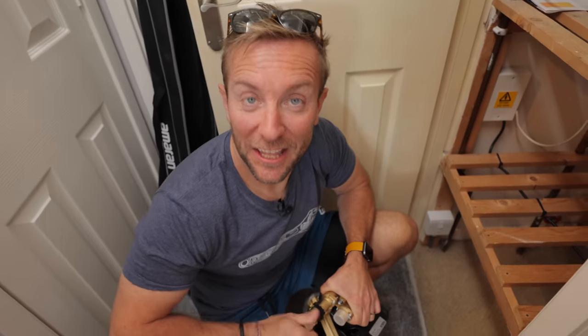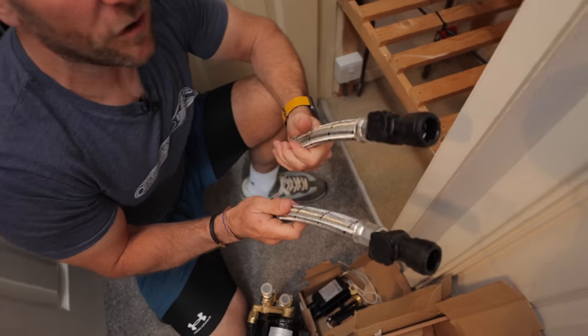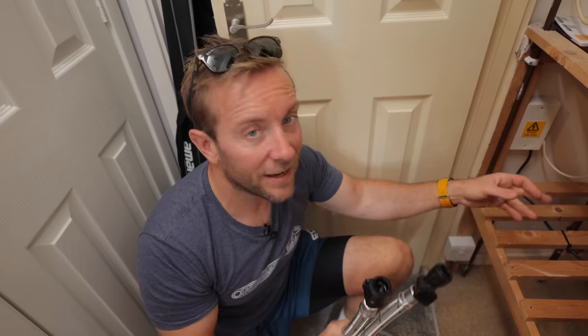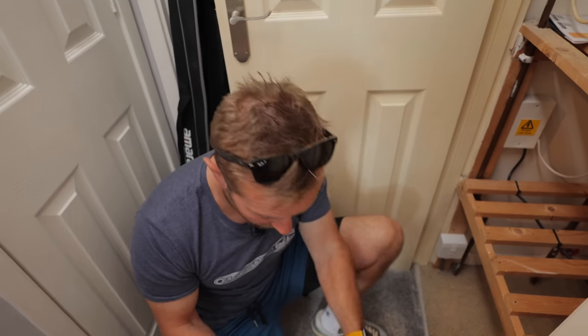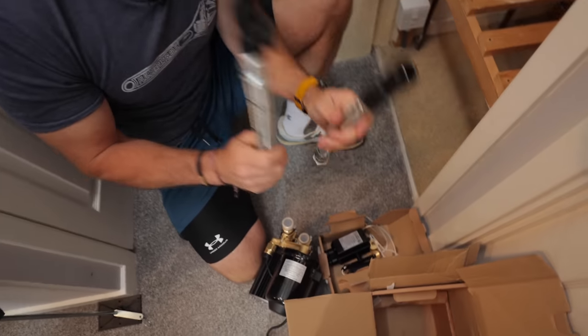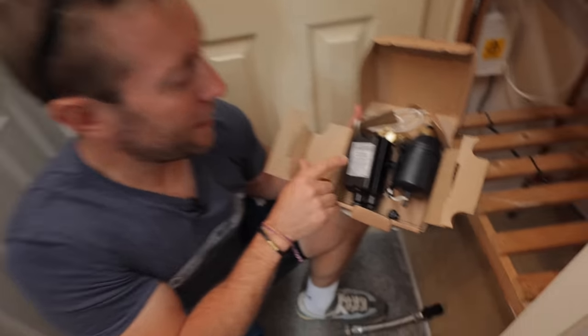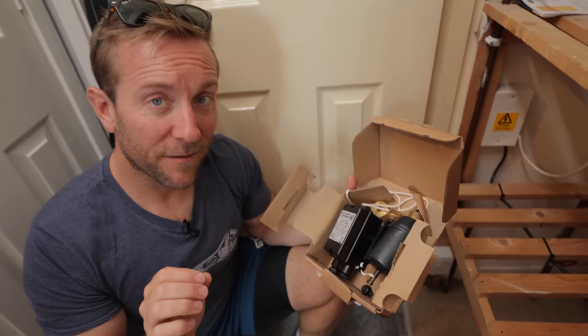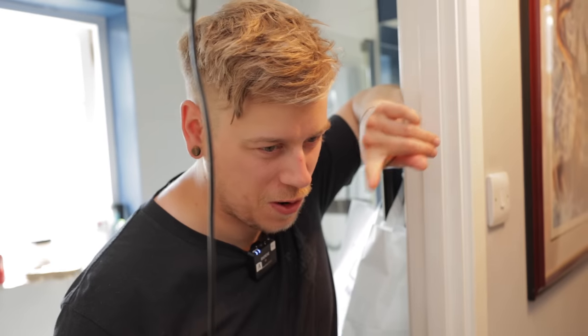This is a Stuart Turner pump — not sponsored. Usually you get flexes in 22mm on these but you can get them in 15mm. We're doing it in 22mm because our feed pipe is already 22mm. We're also going to fit this lovely float switch. Lee's read the instructions. He says it's just like a light switch. Pretty much — but with water involved. I'll do the electric, you do the water.